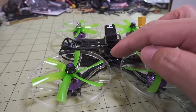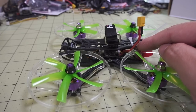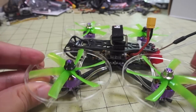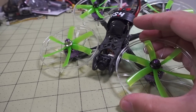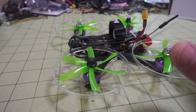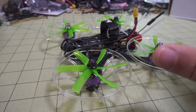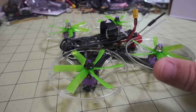The motors are from the X140HV — it's actually a 6S setup, with a low KV motor for three inch, I think a 1507 2500KV. There's a 25-amp ESC and an F4 flight controller. I'm not using the stock video transmitter since the X140's VTX is 20x20 and there's nowhere to mount that on this frame, so I'm using the Eachine Nano V2 instead, which has a built-in microphone. The camera is the Foxeer Micro Arrow 19mm. I flew this on 3S to run very low RPMs — it still flies totally fine with the six-bladed prop and is much less noisy than a traditional cine whoop on 4S or 6S.